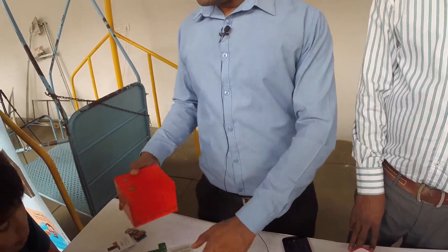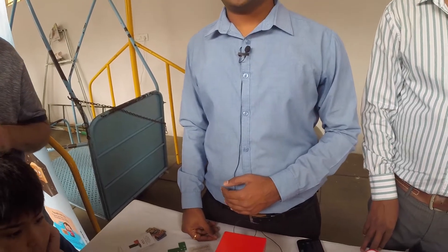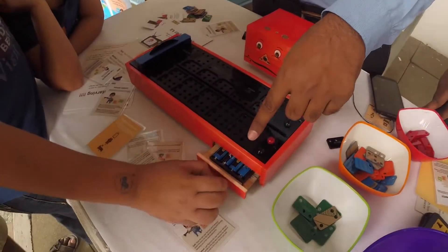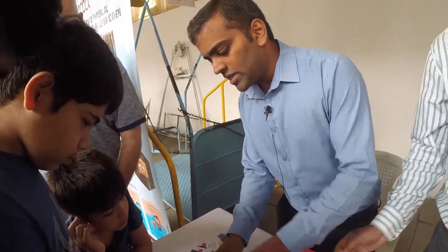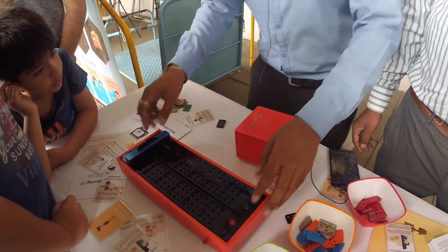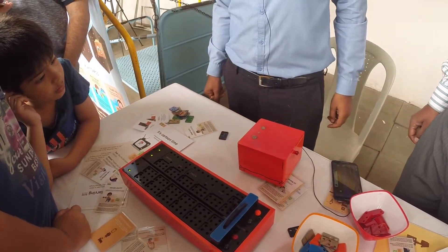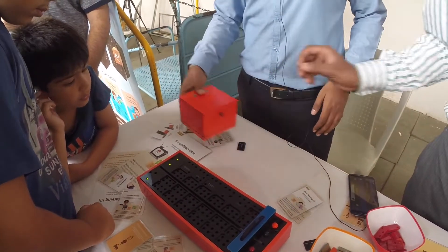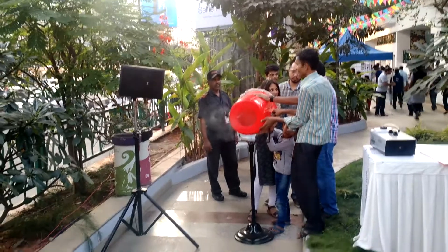The RF range is up to two to three meters. We are using ATmega 2560 for the main board and Arduino Mini for the robot. It has rechargeable batteries. In the demo: switch it on, the program is ready, scan the slate — and since there was an obstacle, it turned right and keeps going straight.